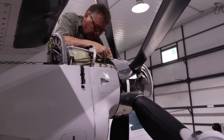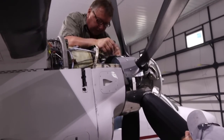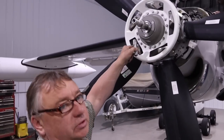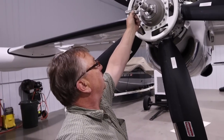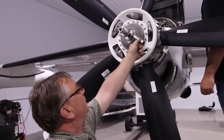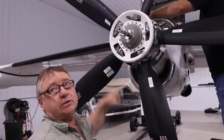Now we just have to find a spot for the accelerometer. One important thing to remember when mounting the accelerometer is that you always want it directly in line with the shaft. If I put it over here, it's not directly to the shaft because there's a flange in the way. It doesn't matter if it's upside down or positioned differently, just so it's aligned with the shaft.